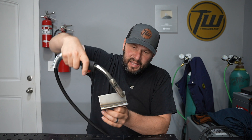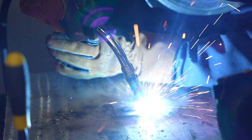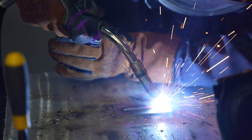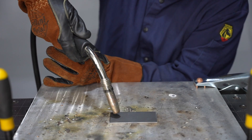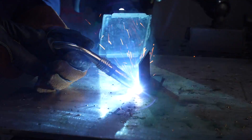That lets you see the puddle. Coming straight in and out works too, but the main thing is to be consistent. If you're welding aluminum, running spray transfer, or running flux core, you do have to either push or drag for the process. But for most of us running short circuit MIG, you can push or pull and it works out fine. Travel angles are pretty straightforward, but you can end up rocking your wrist in an uncomfortable position without realizing it, so try to slide and maintain that along with your stick out — the two are interrelated.